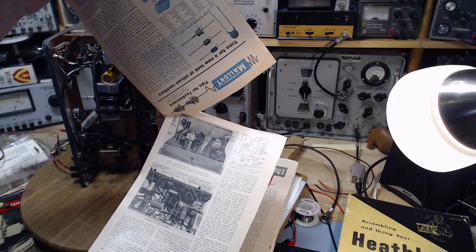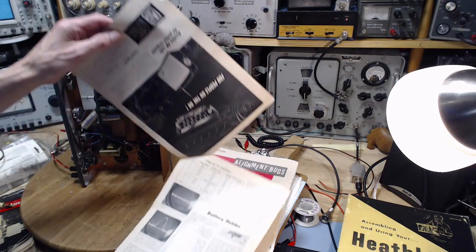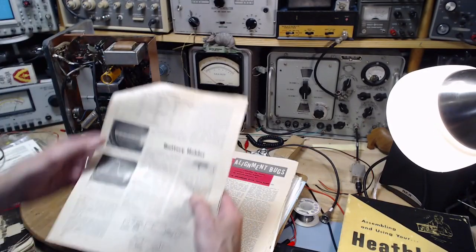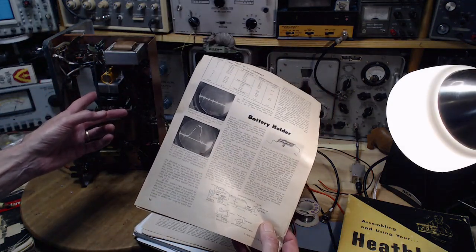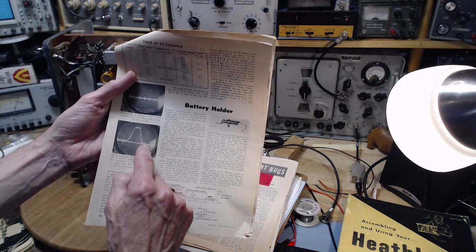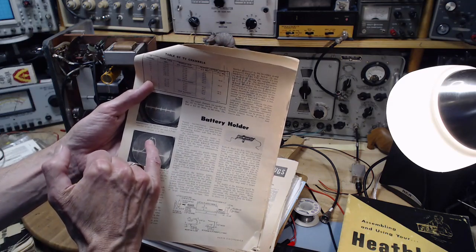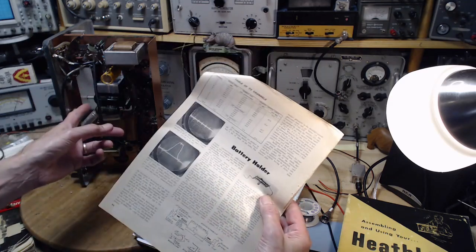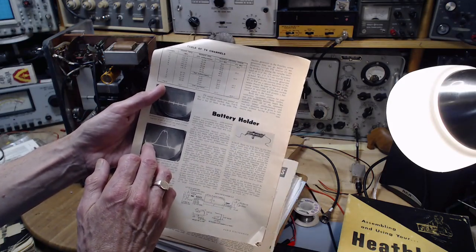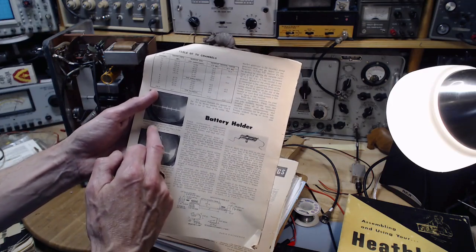So the idea here is you get two big benefits from doing this. It's kind of revealed in this diagram here. In many cases, a device like this can produce the main signal, which would produce a main trace like this, and one pip. Pip is the word they use for these little marks you see. And this is coming from the other signal generator that's built in here, that you can then mark, if you like, where these frequencies occur on this curve.